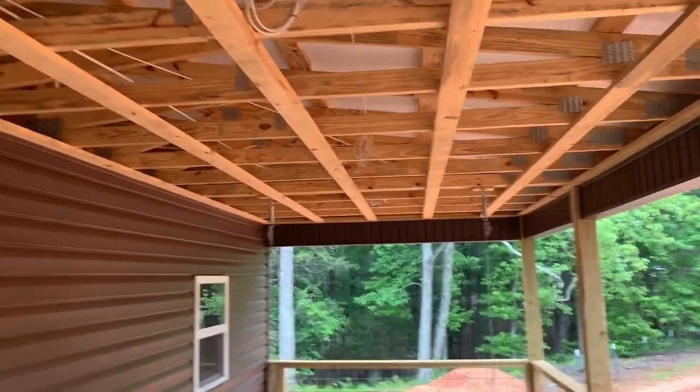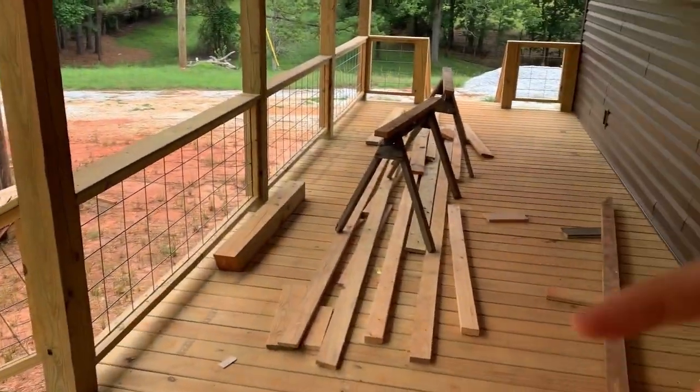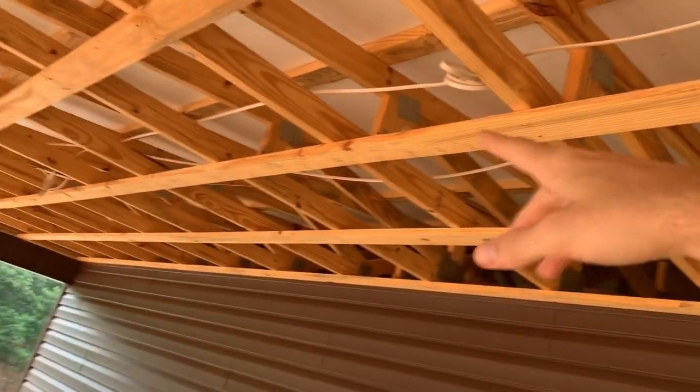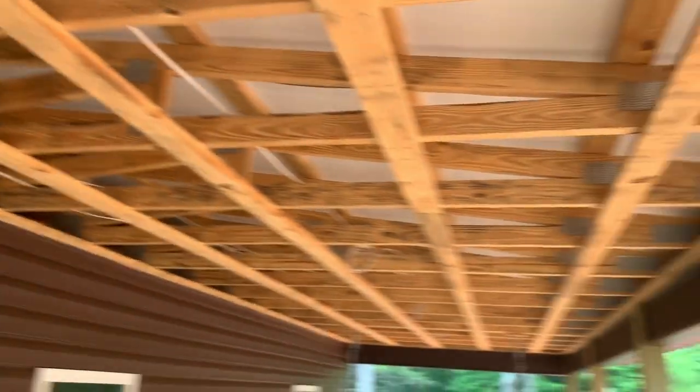We just got 6 lights, one basically in between each post there, and none in the center of the steps because we got these side lights here by the door. But anyway, this run over, we got them looped in. That way, all you gotta do is snip them and attach them to the can lights, because we're doing can lights out here too.